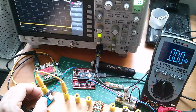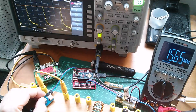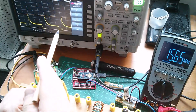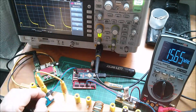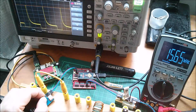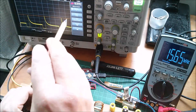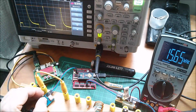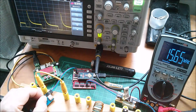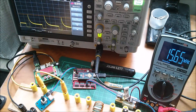We simply can't have that sort of voltage across the terminals of this MOSFET. The bulb, now reflecting off the front of the meter, absolutely doesn't mind the spike — it doesn't mind having 60 volts going into it very briefly, because the power in the bulb is just the area under the curve. The bulb is almost acting like its own thermal capacitor, storing energy in the filament and smoothing out the transitions. But the electronics doesn't like this, because the flyback spike from the inductor is so high it's hitting the crowbarring effect of the MOSFET.